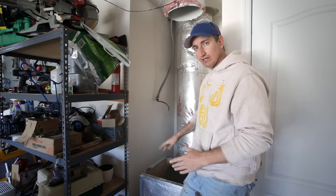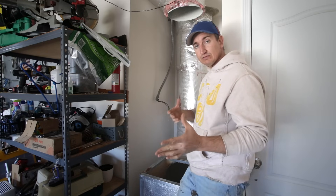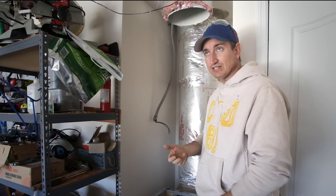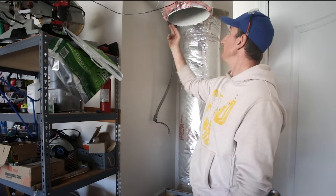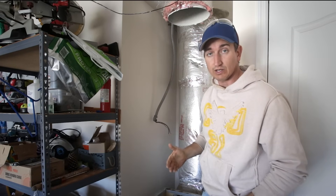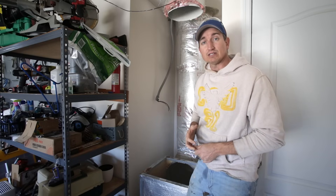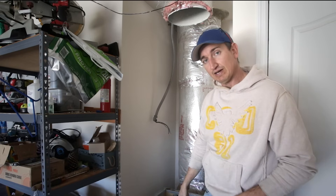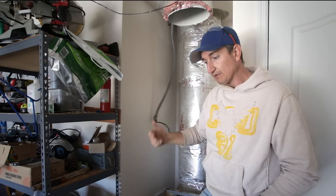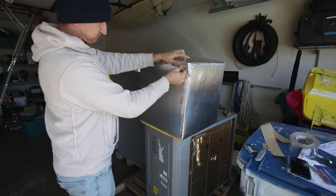We have the old handler out. Now it's time to put the new one in. It's very similar dimensions for the most part, but it's a little bit taller than the last unit, and that actually causes some complications — I have to attach it to the new air handler and it's going to require some custom metal work, some custom ductwork. Not my expertise, but something I'm just going to have to do. I think the base plenum box is going to work okay, but I have to build up the top.